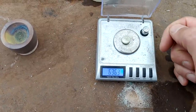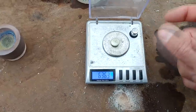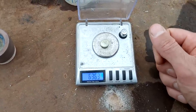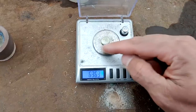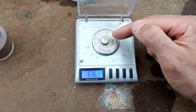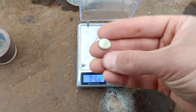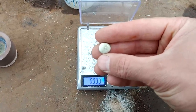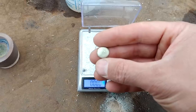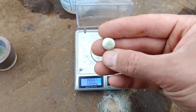All right, well, doing some math, 32 pounds is right around 14.5 kilograms, and taking that weight in grams turns out to be about 450 grams per ton, which squares almost exactly with the estimated pan we did at 1 kilogram. We got about 450-500 grams a ton, so that squares. But judging by the color here, we're going to call it 80% or so. So instead of 450 grams per ton, it's about 360, or what is that, about 12 ounces a ton? So that's not too bad, Jeff, 12 ounces a ton.